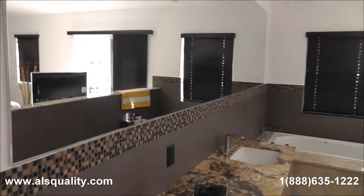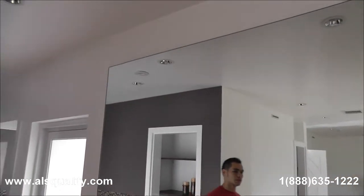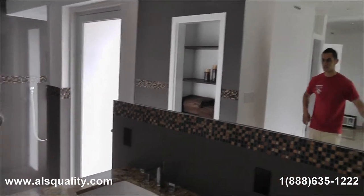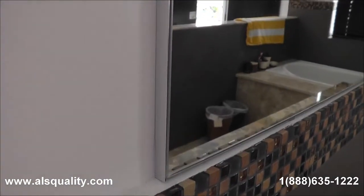The customer is actually very pleased. We just finished doing the installation of a large mirror — it is over, I believe, about 144 inches long. It is a quarter inch clear and it was custom made to match the level of the backsplash that they put. That gives it a really really big look to the bathroom. And then on the side we installed an L-shaped metal to cover any side view of that mirror, because there is always a gap between the wall and the front of the mirror, so we like to cover that with a metal channel.